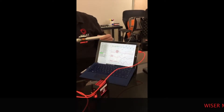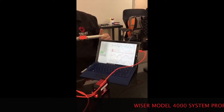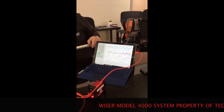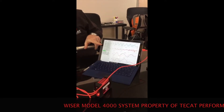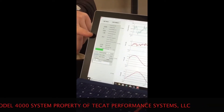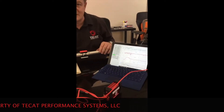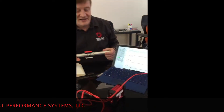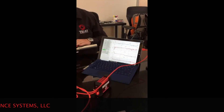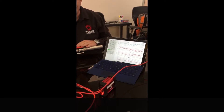It's actually measuring plus or minus 1g — it's measuring gravity as this thing spins from the accelerometer. In addition, we have some low-speed data channels over here on the left. It displays the high-speed data, but it also has things like the processor temperature, which is a good surrogate for ambient temperature, since our processor doesn't really generate any heat. We can also put on-board pressure sensors for either gaseous or liquid pressure monitoring.